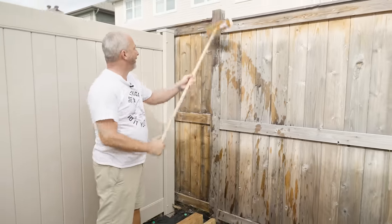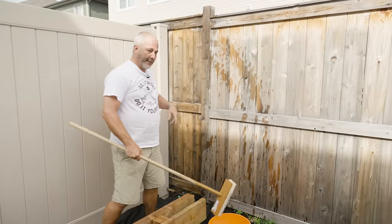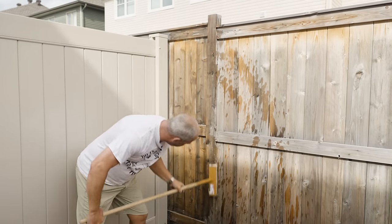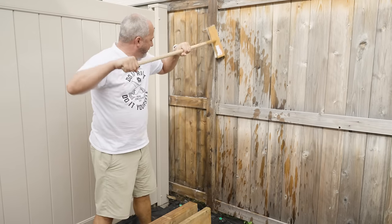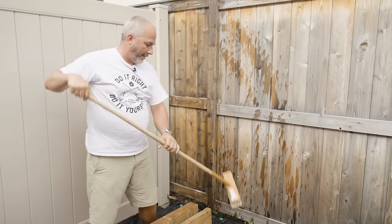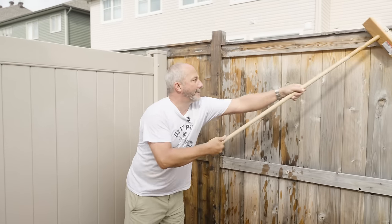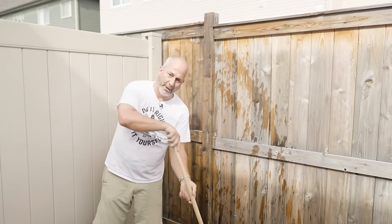So think about it. You got a product that's designed to last 50 years, but they never put caps on them. So the posts rot out pretty quick. And then they don't put any kind of finish on it, so the 50-year wood only lasts 20 years. So you got millions and millions and millions of dollars of cedar fencing all over town. Countless number of trees cut down to make a pretty fence. You know, cedar actually costs almost twice as much as pressure-treated lumber.